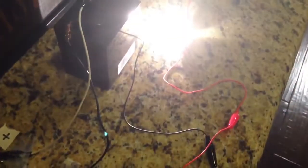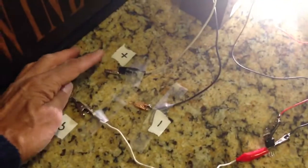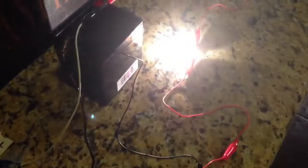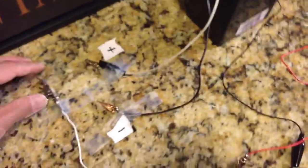There we go — it's full on, just by touching it like that. Now touching the negative makes the charge on the gate more negative, and that turns it right off. It's so sensitive my fingers are not even wet and it's working.